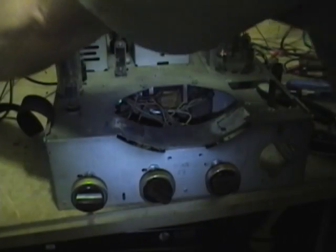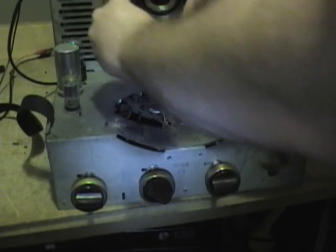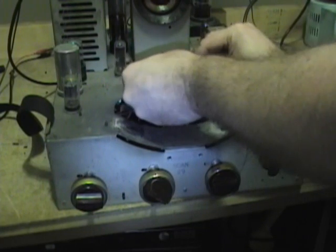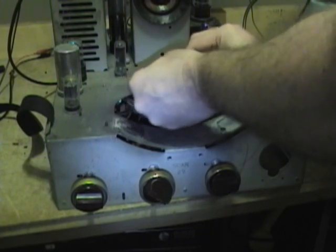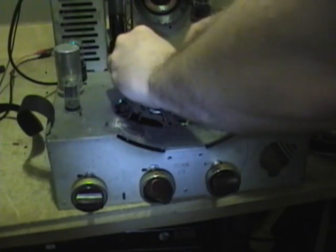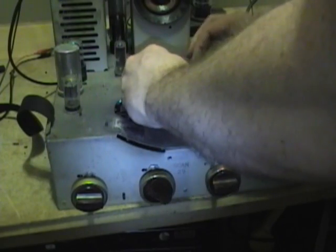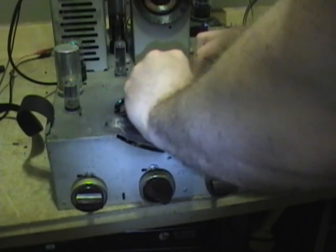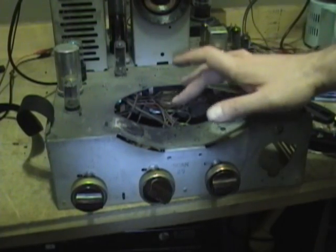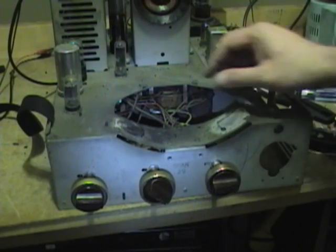As for that grounding hoop, I think I've got a spare one of these somewhere. To give you some idea of how they work, it kind of hooks down under there, and then underneath. This one might not be the right size, but yeah, something like that. And then this part brushes up against the conductive coating on the outside of the picture tube.